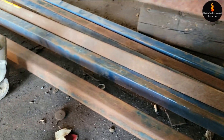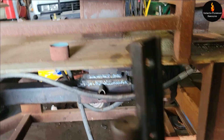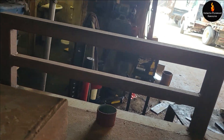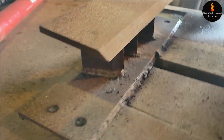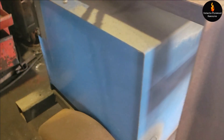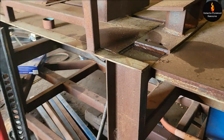We've got to do the log lift. I just brought these pipes and tubes and they're going to put the log lift on the other side, and they might have to move around some hosing. We might have to move the valve so that when you use the log lift you don't pinch yourself - from here to here is about 16 inches so you don't really have to worry about pinching. This one we'll take off and shave down an angle on the ends because it sticks too far in. It should be leaning out because with some of those big blocks it might be in the way - if you get a three-foot block, that's going to be a problem. He said my hydraulic tank is overkill but I got a good price on it and won't have to worry about overheating. I'll come back when there's more progress.